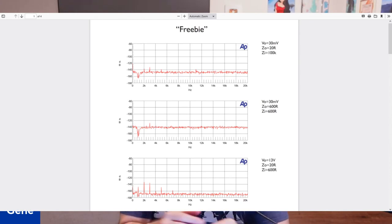We did measurements on cables — just cheap OEM cables that come with your hardware — and we put them on an Audio Precision, one of the best analyzers in the industry. You can see there's no distortion. In fact the only thing you're seeing at 13 volts is the distortion from the waveform generator itself, and it's down to minus 140 dB, which is way more resolution than you're going to get with even the best audio gear. If there was some type of diode rectification because the cable was oriented the wrong way, you would see a distortion in this plot — and it's not there. It just does not exist. So when it comes to speaker cables, if someone is telling you the copper is directional, it's a bunch of BS. Run away from that nonsense.